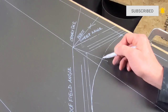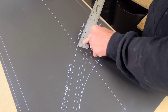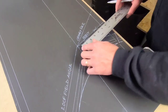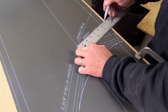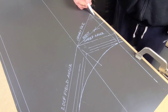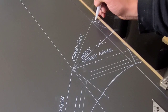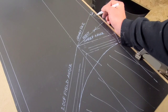Keep in mind when making these slopes, try and make them as gradual as possible — it will help in the fabrication and the double folding. I'm going to measure that and measure the rest of the lines: the sweep angle line and the bisect line. So the chimney face true height is being transferred to the sweep angle line and the bisect line. And now I'm connecting them all. Make sure to follow along in this process. If you need to pause the video, please do, or rewind and rewatch. These are important aspects to this detail.